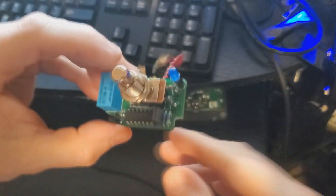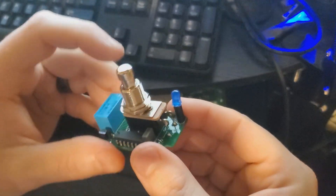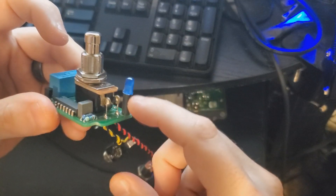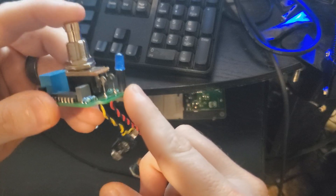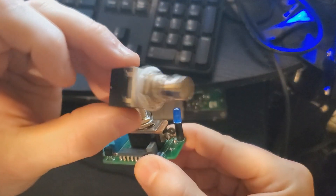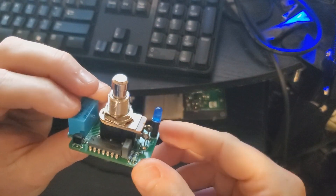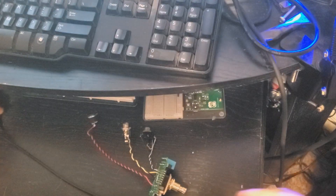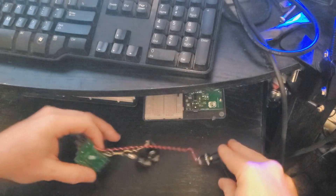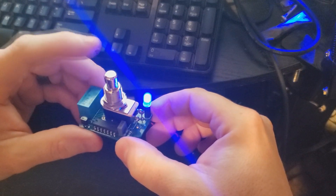This is all driven by NAND logic, which we'll go over in the schematic. We also include the LED here with a standoff guide. If you're using a Carling-style stomp switch you'll be looking at about a 12 millimeter standoff. If you're using the larger ones, you'll probably be using a 20 millimeter standoff to hold up your LED. The idea is pretty simple — it's a true bypass switching system. When you click on it, that'll make the relay click over.